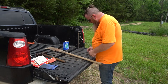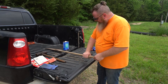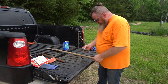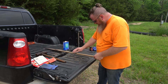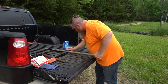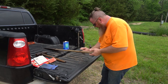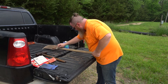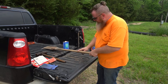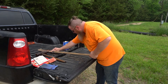We're done with the sandpaper. We're going to move on to steel wool. What does the steel wool do? Well, when you sand this down it's actually kind of rough, and what the steel wool does is take those real small wood fibers off that are standing up — that's what gives it that rough feel. It doesn't take much. That's already as smooth as a brand-new baseball bat right there, or a pool cue. That stuff looks wonderful.